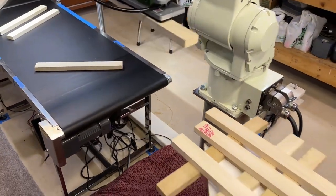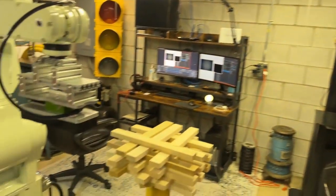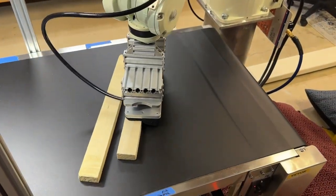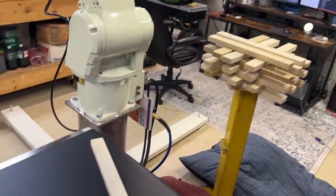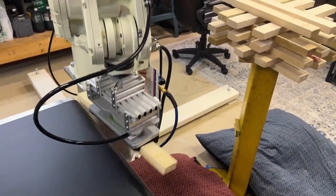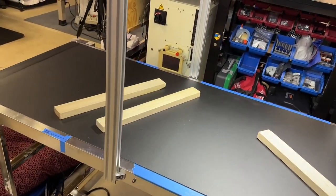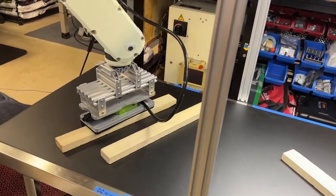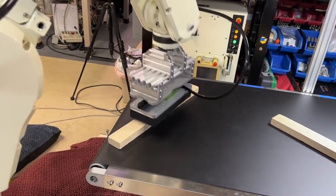Now in the robot controller, I have it set to move to the sent position in 1 second, which means no matter where the board is at, it will make that move within 1 second by adjusting the speed value. So if my PC program just sends a location value of where the board will be in 1 second, then the robot arm will perfectly meet the part. Once the robot meets the part, it activates the gripper and then uses a draw function, which is typically used in a welding application, to follow the part at the inputted speed and then places the part.